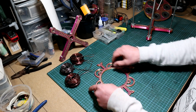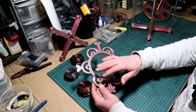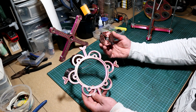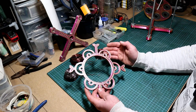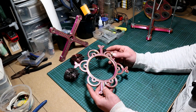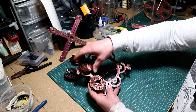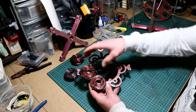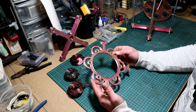Now let's talk about the coils and how to configure them. On the coil 3D model we got a place for six coils, and they can be configured as a monophase meaning all the coils will be placed in series. This will offer a high voltage while spinning at low RPM but will not offer a high current. If you go with a two-phase or three-phase configuration you'll get more power but in result less voltage.